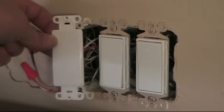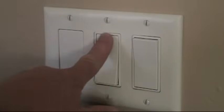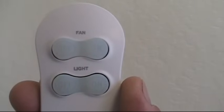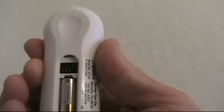We'll put this plate back on, turn the power back on to the circuit, and test our work. The switch plate is installed and switches are back in position, with a blank cover plate for the one we don't need. Here's a close-up of the Hunter remote control — the fan button on top for on or off, and the light button below that. These are pin jumpers that have to be in the same positions as the dip switches in the remote receiver. As you can see, there's a pin jumper on positions one, two, and three, and four is left open — the same as the dip switch being off on position four in the remote receiver. Insert your battery in the battery compartment and your remote is ready to go.